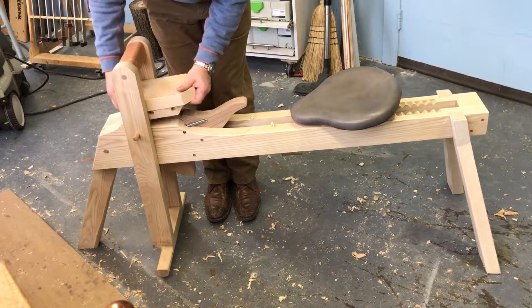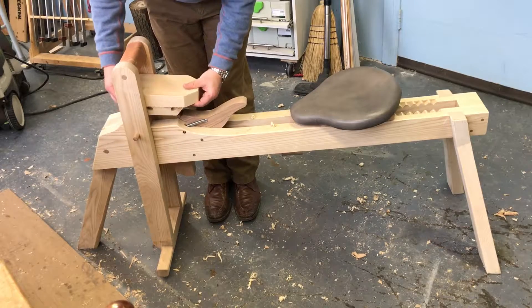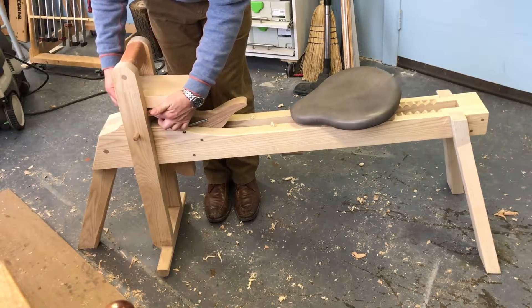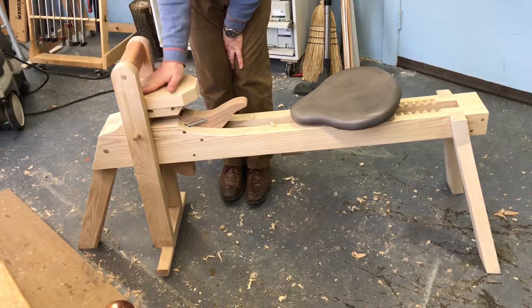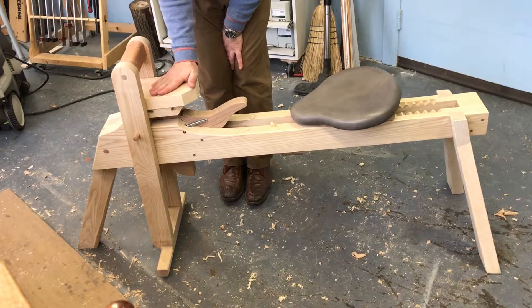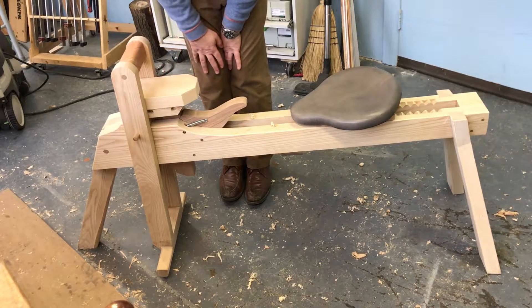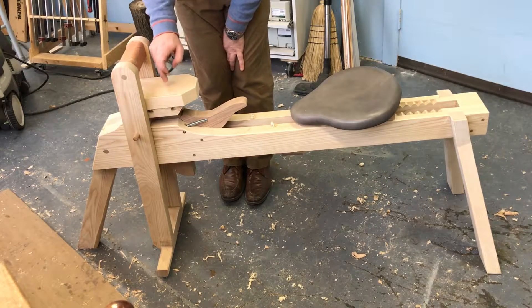The tilt — it's got a pivot point here and then a wider one here, so it allows it to move inside this elongated slot. There's a piece of leather on the yoke and a soft piece of pine. You can face this with leather, but I just use a soft piece of pine. No wood that I work is going to be softer than this, so any marring is going to occur on this.